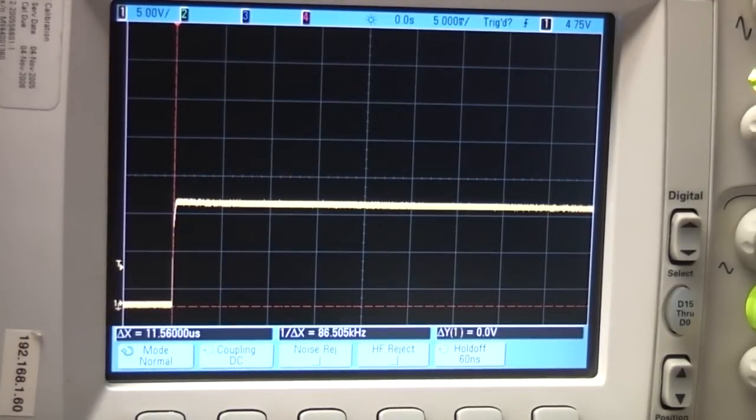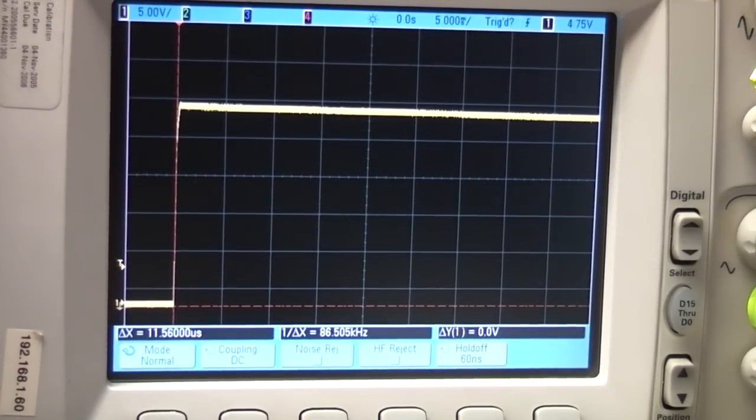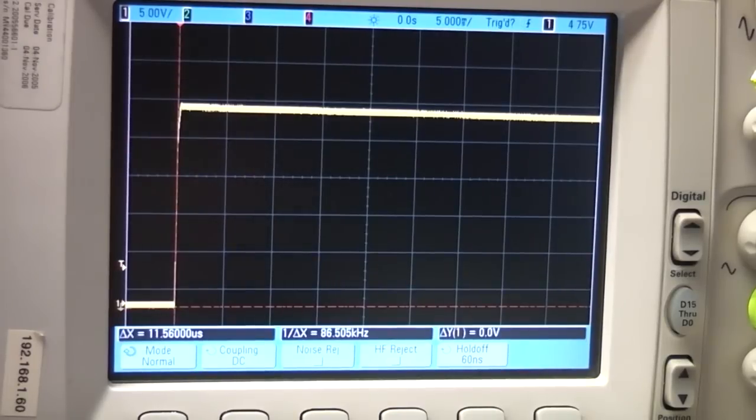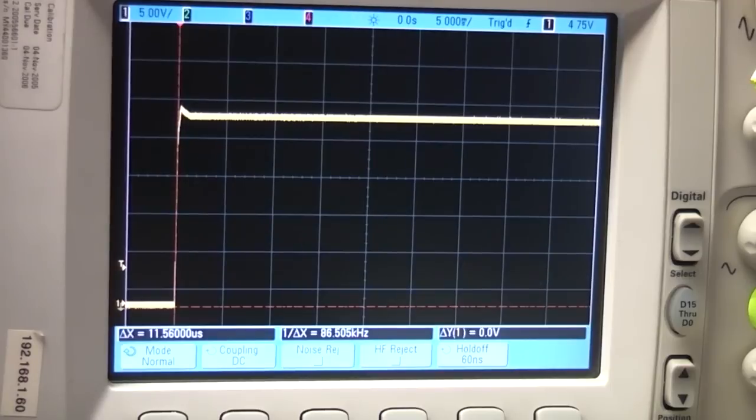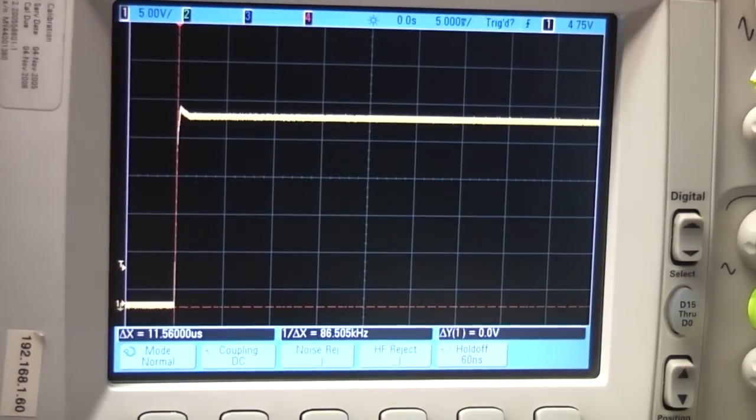We'll try a different voltage, setting it to 25 volts, turn that on, again fine, no overshoot whatsoever, quite happy with that. Let's try under a bit of load. I've got my 12 ohm resistor again. So this is turning on 25 volts with 12 ohms across it, so that's 2 amps supply. Turn it on again, very small little overshoot there, but I'm not too concerned about that.